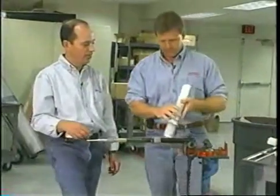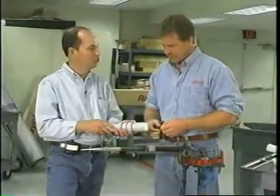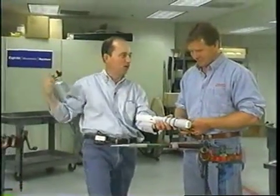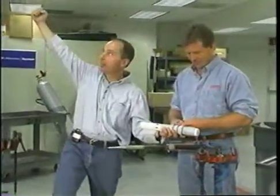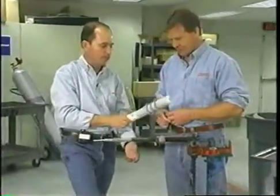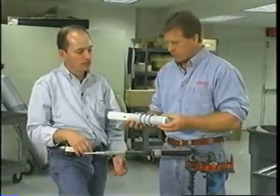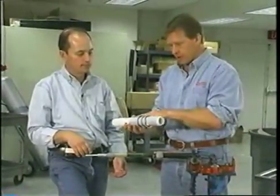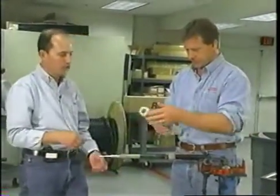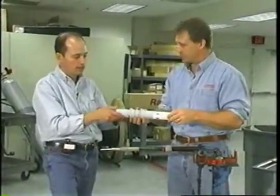And now you're going to install the outer housing. Right, but this looks a little different than what I'm used to. I've seen a lot of these cold applied terminations with an enormous spiral that you have to pull out. You keep pulling this very lengthy long spiral out and you've got to be careful that you don't get your hand up into the high voltage lines. This doesn't have that — it's got something different. Yeah, there's none of that nonsense with this termination. This termination is a silicon body that's stretched onto an ABS holdout tube, and there's silicon grease applied under the termination. It simply slides off the tube.